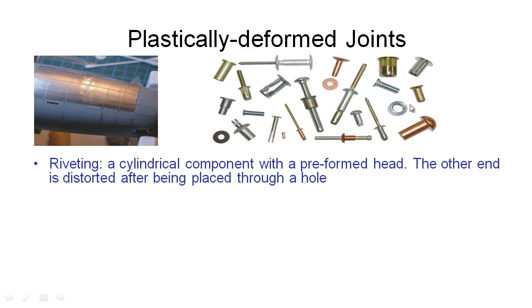The steel then falls out of the rivet. We also have double-ended rivets, where you slide the rivet on from either end and then it's deformed and held in place. We also have a split-legged rivet, where you push it through and then fold the legs outwards to stop the rivet coming out of the hole. A wide variety of different options to choose from.